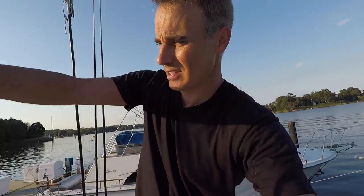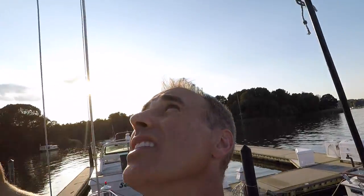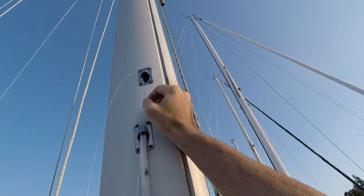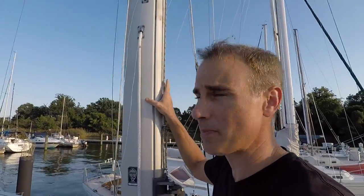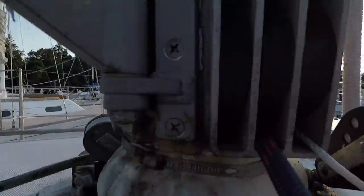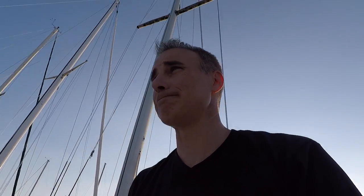The fishing line with the weight went down and stopped. I was actually able to fish it out partway — the long part is still going to the top of the mast but it stops midway. We're really at a loss. Our only hope was that initial cable. What happened was the cable was chafing along the way as Sam was pulling it up, and at one point it just broke. Kind of back to square one.